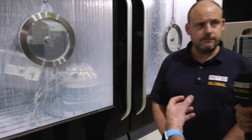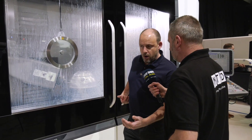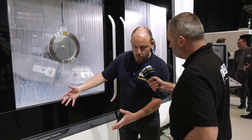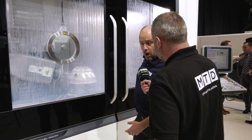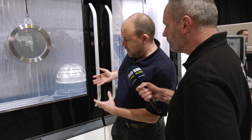Where would you put this type of machine — what sort of application, companies machining complex parts, one-offs? The beauty of this is that because you've got that bigger working envelope, you could load the table up with components at one end and also put parts at the other end of the table, essentially using all of your working envelope to maximise productivity. At the same time, you can have a very large bolster which could take up the whole working envelope of the table. You could do five sides of a part using the table here, and then do your finishing operation to the left of the table. Very, very diverse.